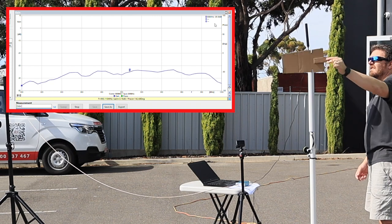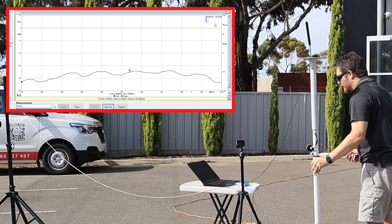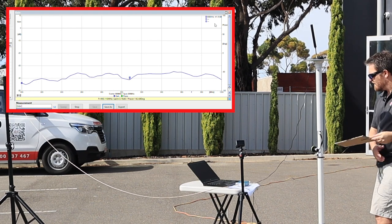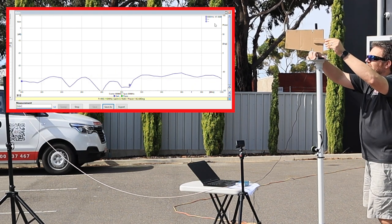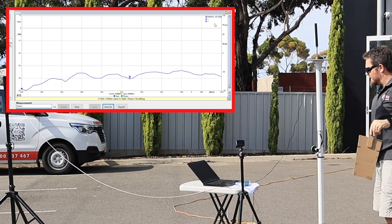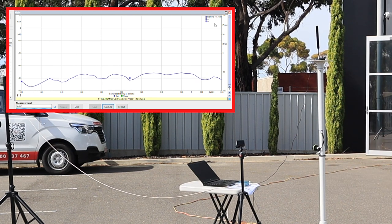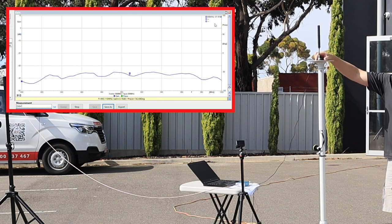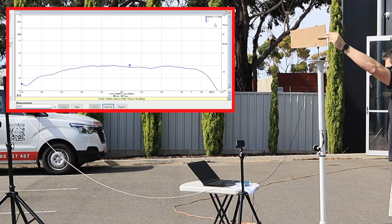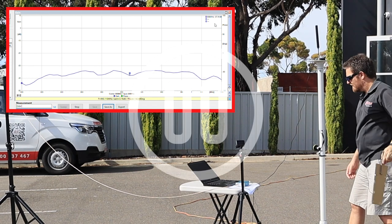I'm going to put the Yagi in position against the antenna, with the dipole correctly spaced — just like that, converting it to a Yagi. There we go. Take it away, put it back — huge effect. If I move the position, reflections are really causing trouble. Moving it to my worst position and then smoothing it out, I gain as much as I need. It's outdoors so it's not always smooth, but you get the effect — this is what it does, and you can do the same yourself.